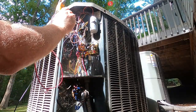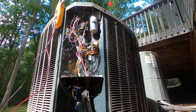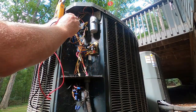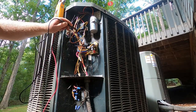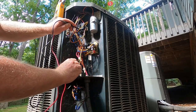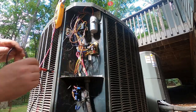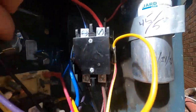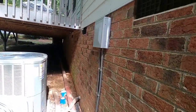I can't push the contactor in because it's got this cover plate on it, so I'm just going to check for voltage. I have nothing - I don't have any voltage to either leg. So let's go check the breaker.